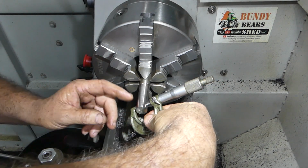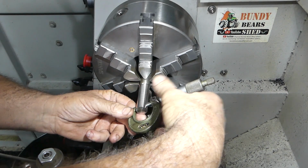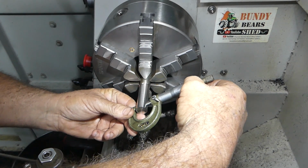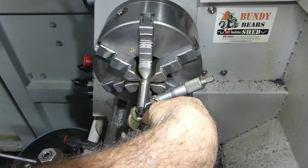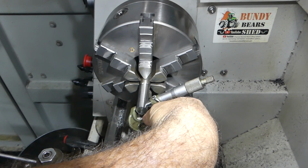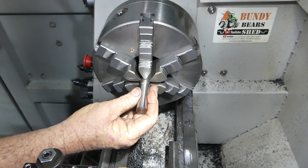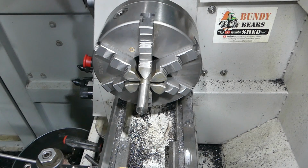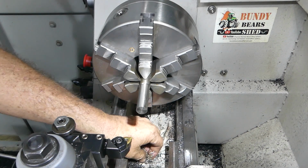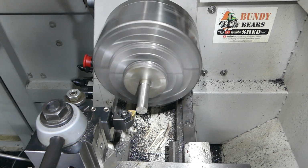To 0.684. Because I've got this end sticking out and it's hard material, I'm getting a little bit of flex there. So 0.684, I'll just set the DRO. And when we get close to, say, 660 thou, I might start doing really light cuts and see if I can get that three-quarter thou or half thou, whatever it is, taper out of it.